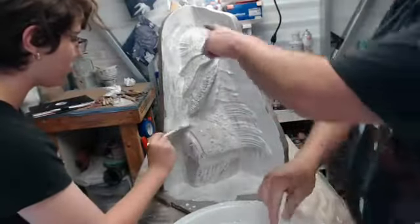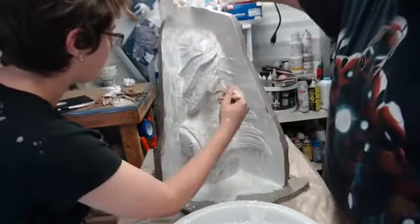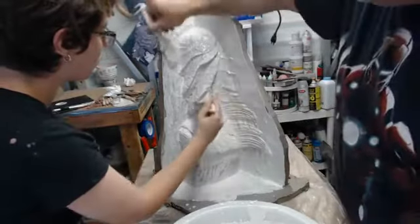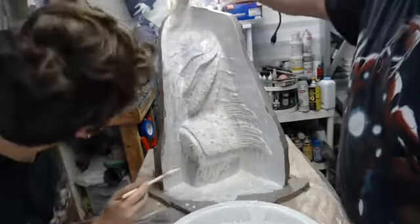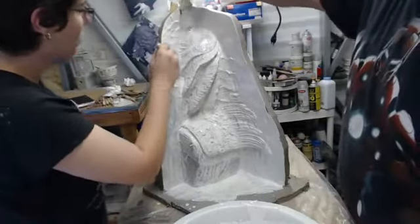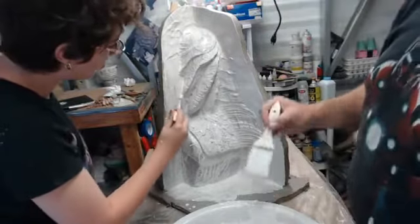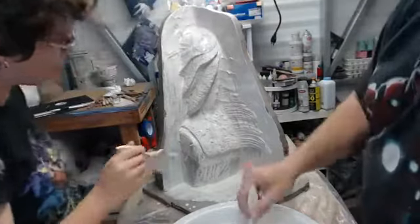You see up here where the moisture flows down, it's starting to ash already. But that's not because of the chemical process yet. That is because it's so thin there that it's starting to cream and do its thing. So without really messing it up, you want to add a little bit more material. You do have to be very careful of creating air bubbles and air pockets in the keys and in the 45-degree angles of the mold wall.